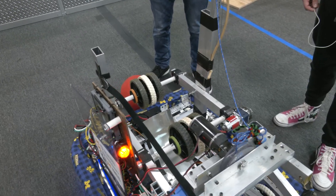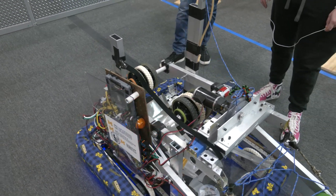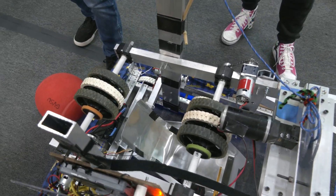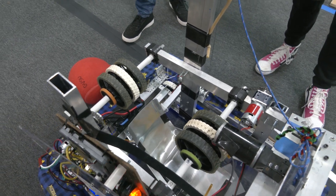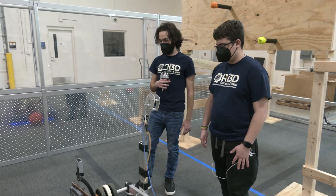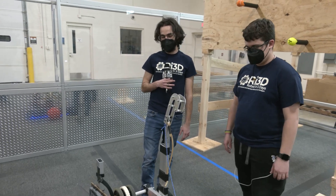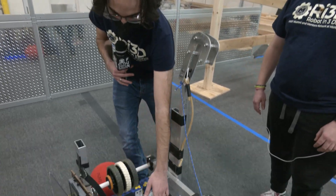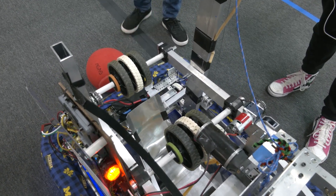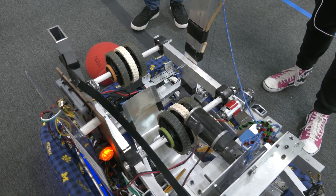Talk to me about your exit angle and velocity. We prototyped a couple of angles, speeds, and compressions between the two wheels. The angle we went with is around six degrees, but we found we have a lot of play with how far and high the ball goes depending on the relative velocity of each of the two wheels. What actually mattered a lot more than the angle was the compression between the two wheels. Originally we had half an inch squeezing the ball and weren't getting the results we wanted, then we switched to one and a half inches and it increased our distance by three-fold.